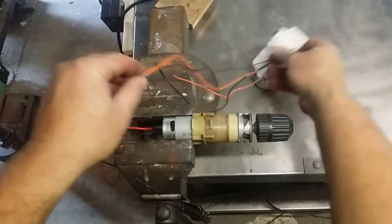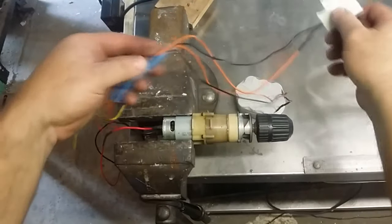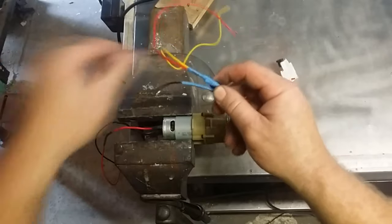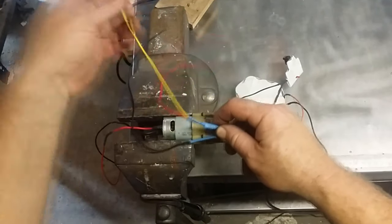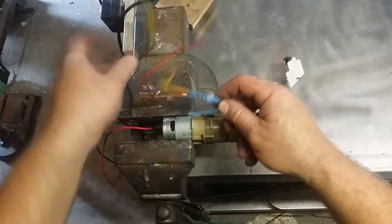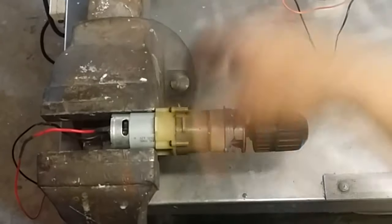They both go back to the battery and can be positioned wherever I need them to be on that little circuit board there. From there I've got the single negative cable and two positive cables. One will power the drive motor for the barrels and the other one will power the lights for the futuristic version. So that's pretty much that sorted out. I can now set that aside and work out the mounting mechanisms.